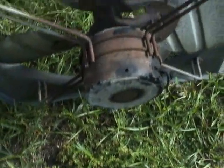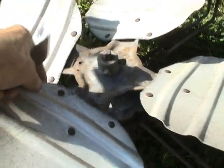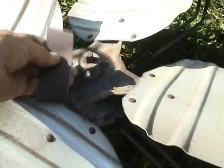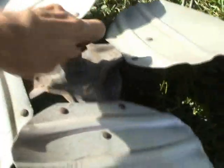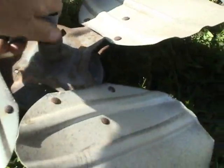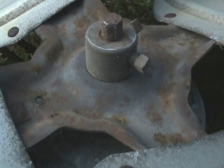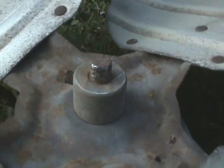There's the shroud with the fan right here, and of course there's the dead condensing fan motor. Now we're going to remove this fan blade from the shaft of this motor. The best way to do that is first use some sandpaper to remove any kind of rust so that the fan blade will be easier to slide off of the motor shaft. I've sanded away a lot of the rust from the shaft.